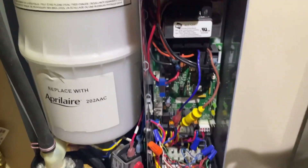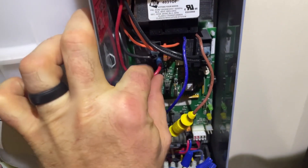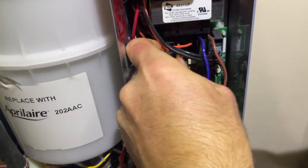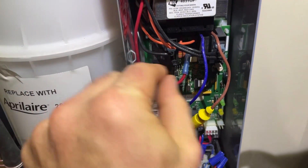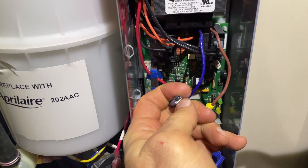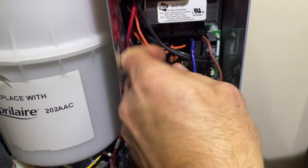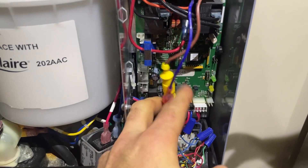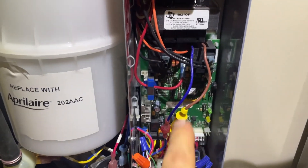Any kind of high current spade connection, you want to check. See that? It's so loose, just rattling around in there. When you replace wires on components with spades, what you want to do is with your needle nose, come in here and crimp the back. That way the front stays open and you can still get it on the terminal. But you need to crimp these down every time you replace them on something like a contactor. I'm just giving this thing a once over, making sure everything feels tight. I'm going to fix that spade.